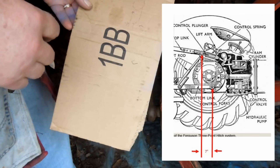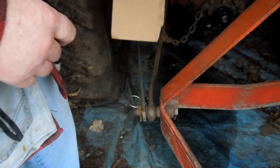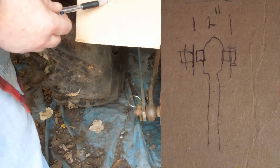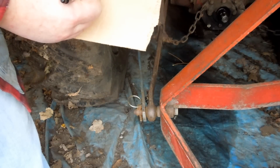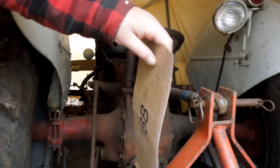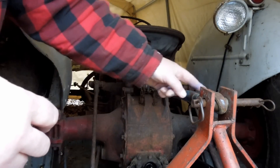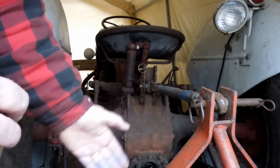Crude drawing, but it's enough to give me an idea of what I'm doing. So, I need to put an extension on the back end of that beam, seven inches long. On that attachment point, I need to give it two inches to allow for that upper arm — that upper linkage — so I can put a pin through there. I'll be able to adjust the tilt on the hoist by lengthening or shortening this. But as long as these two are the same length, this will always go straight up and down.